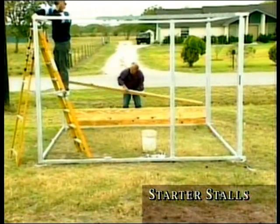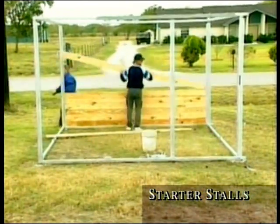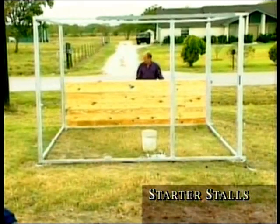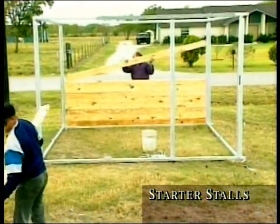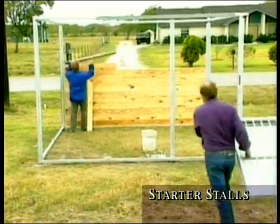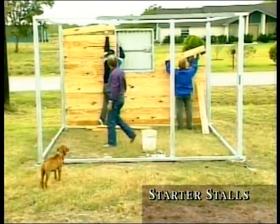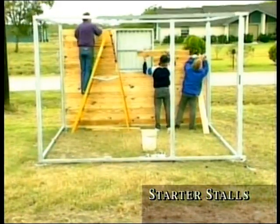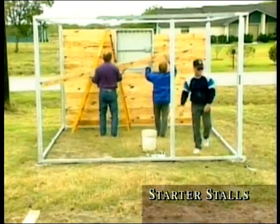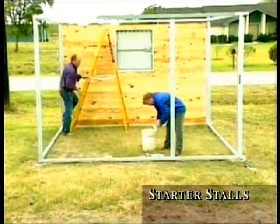Load 10 boards into the channel. Then load seven more boards, cutting 36 inches out of the center of them to make a frame for the window to set in. These boards simply slide into the channel of the post and the channel of the window. Sometimes you may have to cut a slot out of the top or bottom board to fit around the window — this will depend on the milling of your tongue and groove boards. After the boards are in the back wall, you can then install the hold-downs, locking them in place.